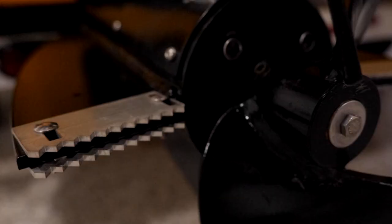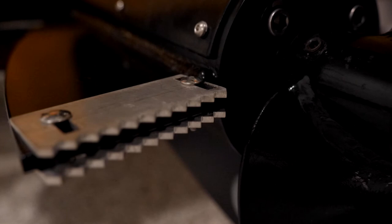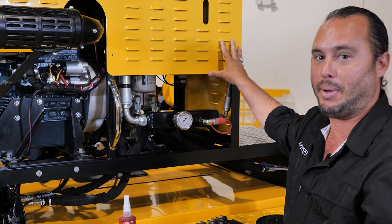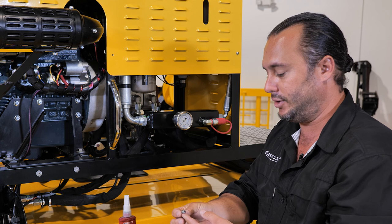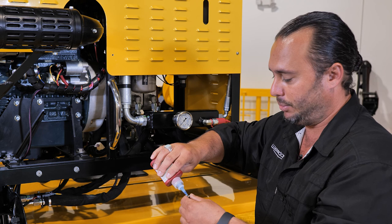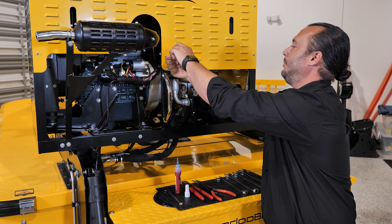There's a lot more to look out for down here too. We've upgraded these drives and added new weedless features — it's important to make sure those fasteners are always tight, because if they slide back they're no longer performing the job they're intended to do. Some other fasteners that can become loose from time to time are the fasteners that mount the cowling to the power pack frame. They're little 10-24 by 1-inch machine screws. When we put them on at the factory, we use a flat washer and a split lock washer, but always keep an eye on them. If they ever come loose, take them out and add a little dab of blue Loctite — it's less permanent so it won't get stuck if you need to remove it for maintenance, but it also helps for anti-vibration purposes. Always keep your eyes on all these fasteners and make sure everything is nice and tight.